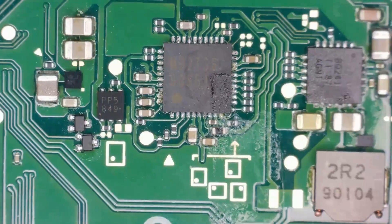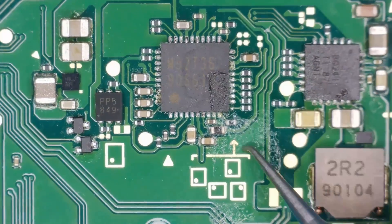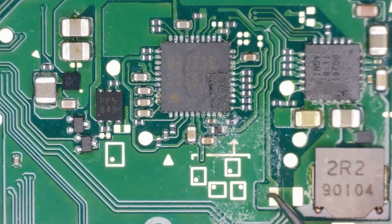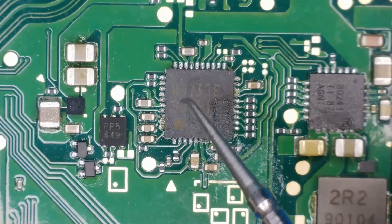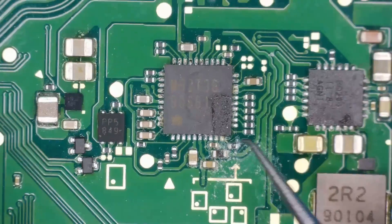Port extraction itself was fine. Turning to the back, here we have the M92T36. There's a substance around it that is not my flux — it's too dry and crispy. I think because of that port situation the M92 chip took a lot of heat, because you can see a little bit of burnt flux that has poured out from the sides.